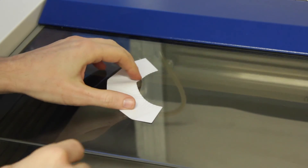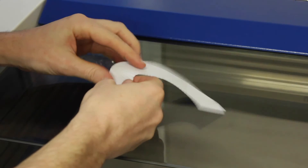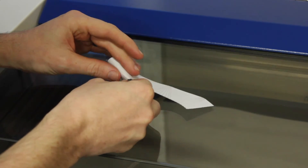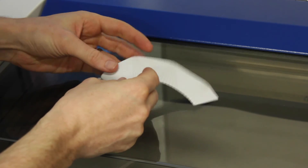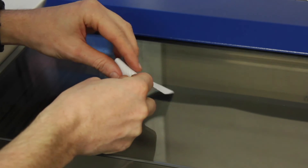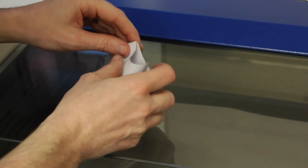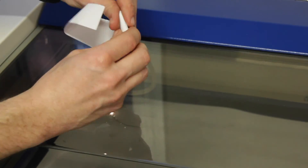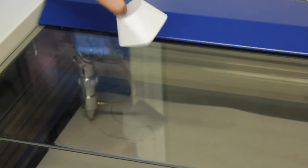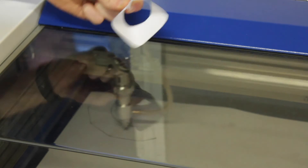Even though it's made out of paper, the principle is the same in any kind of sheet metal. We haven't really got much of a bend allowance, but the engraving that I've done in this paper has allowed us to have some simple folds, and this, when it's completed, is a simple square-to-round conversion.